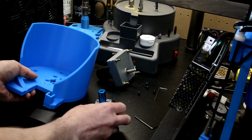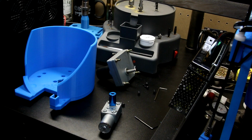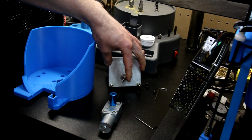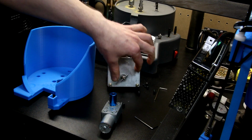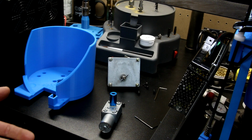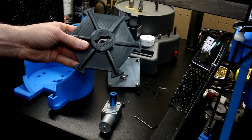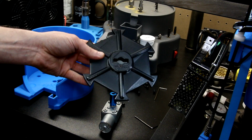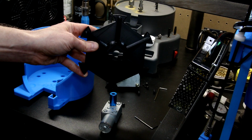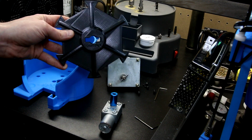The other issue you're going to run into is the bases. Your bases are all designed to fit an 8mm shaft with a roll pin, so you'll need to make new bases or drill out and Dremel the bases you have. And to me, that's really not a big deal. Here's an example of a base I've made because I'm trying to test this as a case feeder, not a bullet feeder. And you can see there's a huge hole in there to fit this design.